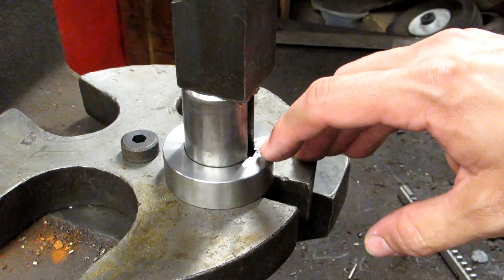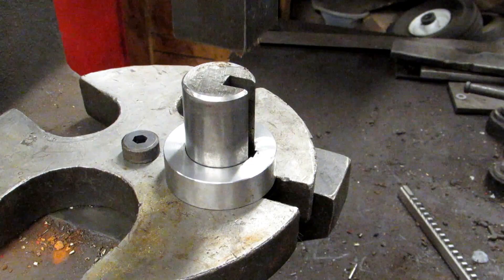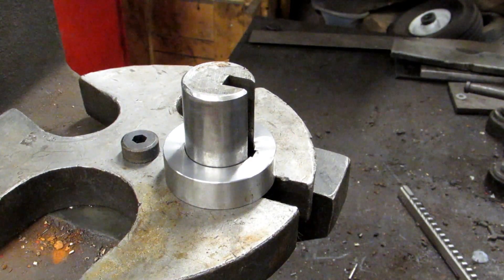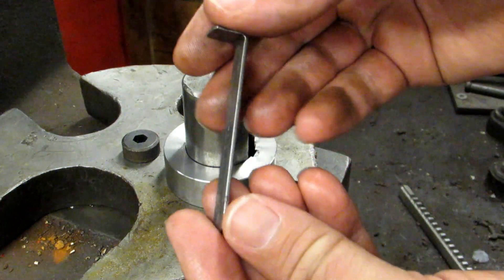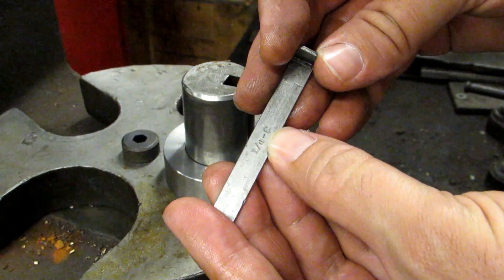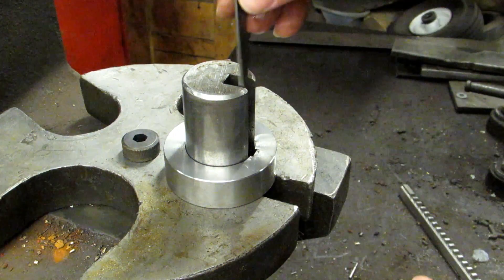You can also see I've got maybe a third of my keyway done. So let me go ahead and reset the arbor press and I'll put a shim in and we'll do it again. The sets come with these shims and they're little L-shaped things — they hook up on top there and they're labeled for the keyway size. So theoretically after two shims you should have a completed quarter inch keyway.